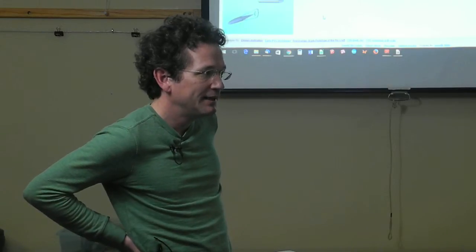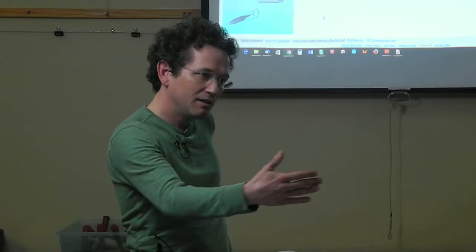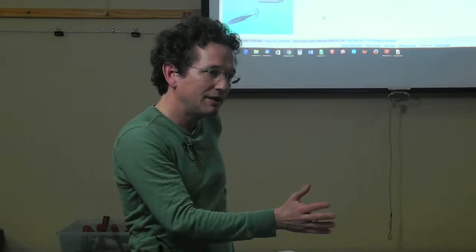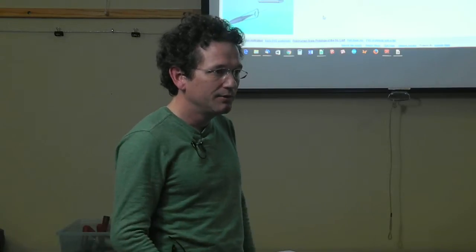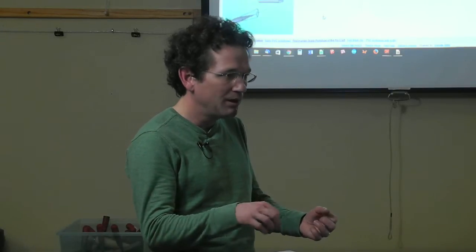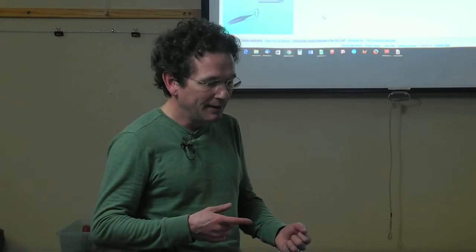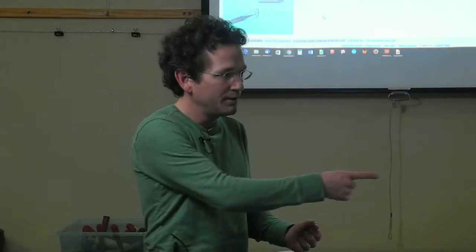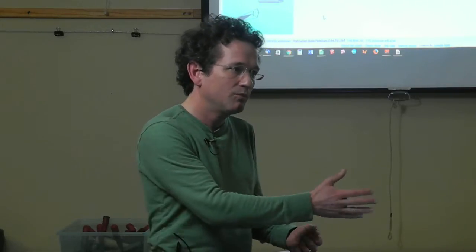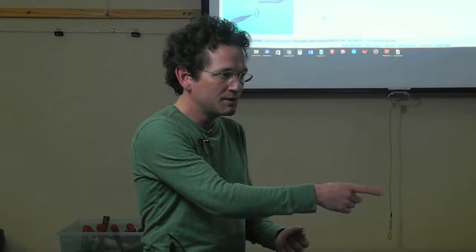Yeah, at a certain point, the rope or the tail, whatever it is, has to have a little bite into the water, and it's got to resist the deflection, and that's the flexure of the fluke. And right now, the flexure of the fluke is controlled by the polyurethane that I made, with a carbon fiber rod down the center of it. I also made it to go in and out of the back of the boat, so to give it more flexure and make it more flexible, I can push the tail out, and then the tail stem is longer and more flexible.